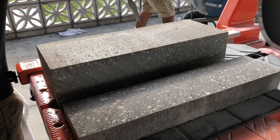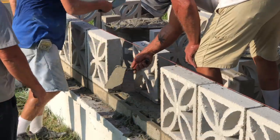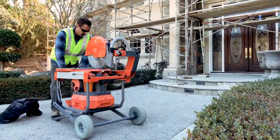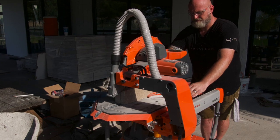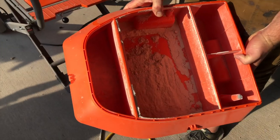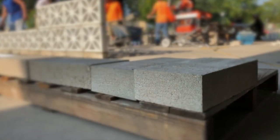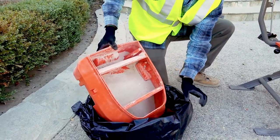The saw just cuts through block like butter — very quickly and very accurately with almost no dust escaping. John had a full commercial masonry crew working on site to create the breeze walls for the joinery, and all the guys there were really impressed with this saw. It collapses down and folds very easily, rolling from one location to the next. You do have to push down pretty firmly to get it to collapse, but that also ensures it won't accidentally fold up on you. Also worth mentioning is how easy it is to clean up the dust — you just drop a lever to remove the three-stage collection tray. Looking inside after making a bunch of cuts, we could literally see all of the dust that we did not put in the air. Staring at that mound of silica, we realized we were only about a third of the way through this one project, with several more taking place inside the facility. When you can dump out dust instead of breathing it in, it's a good day.